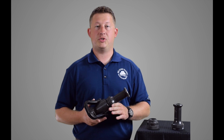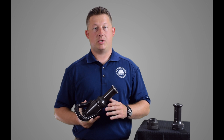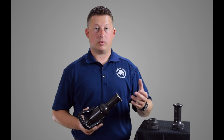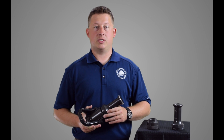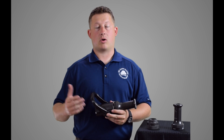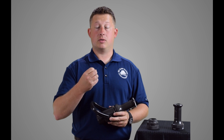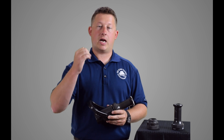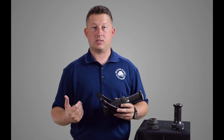The second discussion point is reach and penetration. The reach of this nozzle is mass times velocity — it really doesn't have much effect on whether it's a smoothbore or a fog. Whatever pressure and water volume is coming out of the nozzle determines how far that water goes. But there's a difference between effective nozzle reach versus just reach. A smoothbore nozzle can reach further than a fog or combination nozzle because it's not affected by the wind as much. It is a more solid stream with larger droplets of water, so it tends to carry further and land in a more concentrated target area.